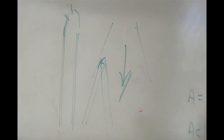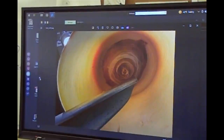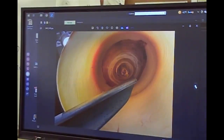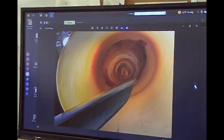If you get the tool handle in the right position, roll the tool just right, and pull it toward you on a real fine cut, it's amazing how thin you can get it. But you'll get to a point where the wood moves away when you try to cut it, and the tool rest might not go all the way in. When you get to that point, you might want to change to a scraper at a bit of an angle — shear scraping for a negative rake, not peeling. Also, brown heartwood transmits light differently than white wood, so the dark wood is thinner than you think. The whole time I'm doing this, I'm squirting the piece with a spray bottle to keep it sopping wet — I don't want to dry it out and change its shape.